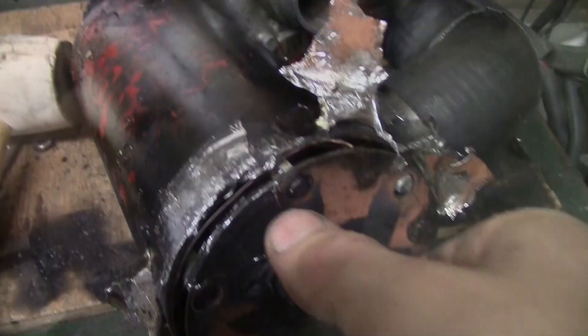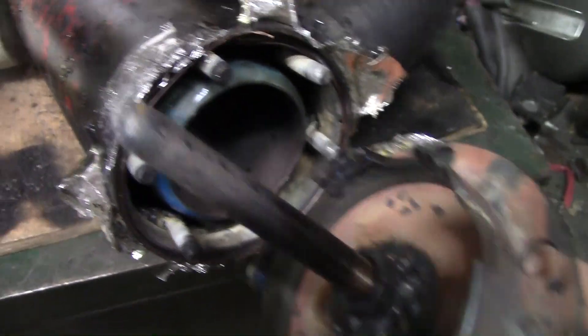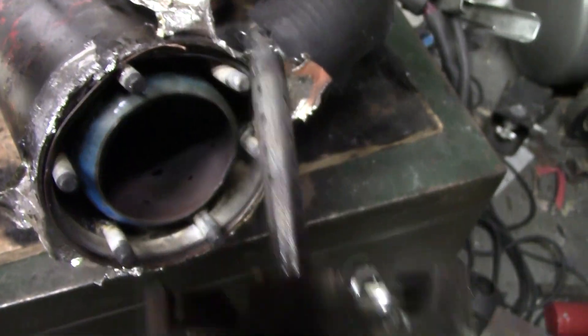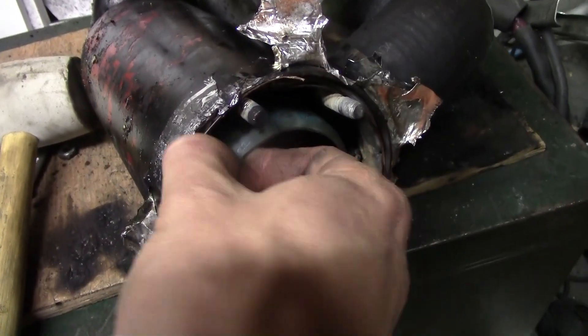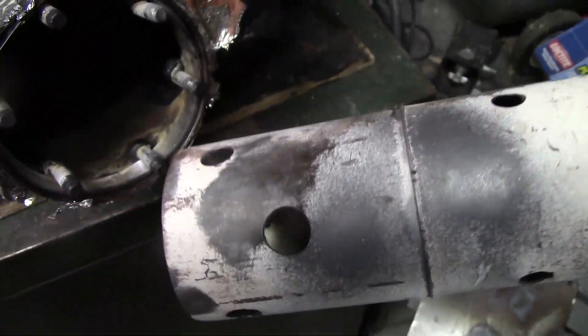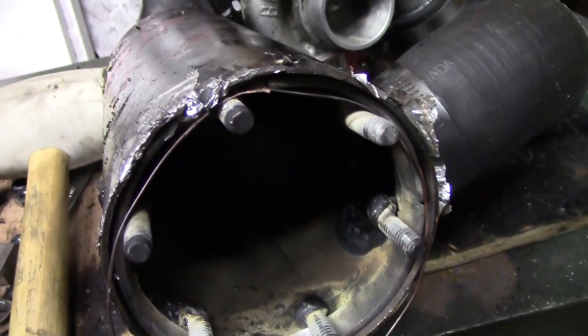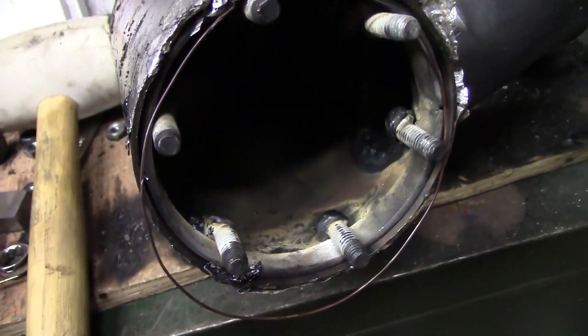Let a little more air through. Inside of the combustion chamber looks like this - got a fuel rod, spark plug, this crown thing which has holes so the bolts can go in and it holds the flame tube. There's the flame tube, looks like that, and then it sits on this little flange there. There's a copper gasket - an annealed copper gasket that crushes.